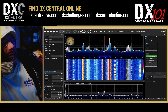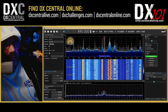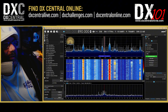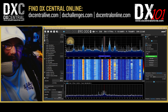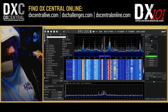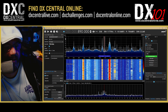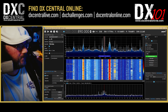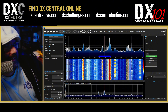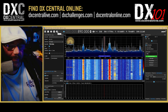There are a couple of ways you can check your source. The source tab by default is usually on the left-hand side, but you may have moved or closed it. You can always get back to it by going up to the little hamburger — three stacked lines — click on that and you'll see an option that says source. Choose your SDR; in this case it's HF Plus Series because I'm on the AirSpy HF Plus Discovery. Choose that device, hit play, and now I've got audio coming — I'm doing my live DX thing.